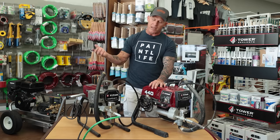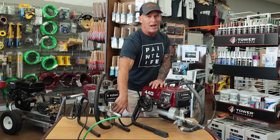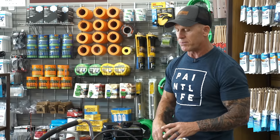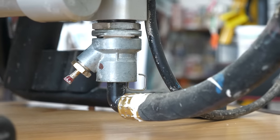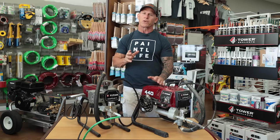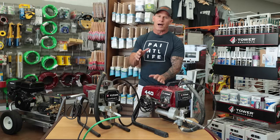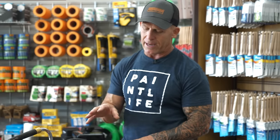It eventually gets all dented up, and you could even crack the face or crack the ball. So it's a trick we use — a hammer — but you've got to be extremely careful. With this pusher, if the ball's stuck, all you do is push it and it will release. If something's stuck in there, it taps on that ball and pushes it up and down. That is a great added feature — it almost makes it worth $148 in itself. I just make it a habit before I start to use my sprayer: just hit that, make sure the ball is released, then turn the sprayer on.